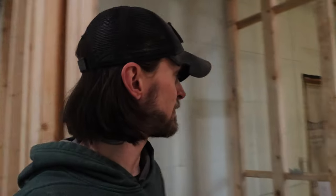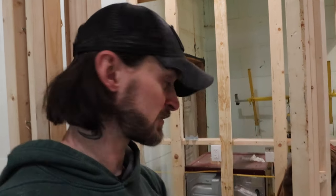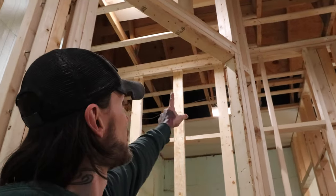Yesterday, I did get some stuff on video, but you guys probably wouldn't have known what the heck I was doing, so I decided just to not show it and just explain it. Inside of the pantry here, we did have to extend this wall out, so I took some 2x4s and turned them sideways, put a strip down at the bottom and a strip up at the top. Again, turn them sideways because laundry rooms do need to be framed out basically in a 2x6,